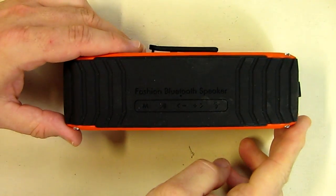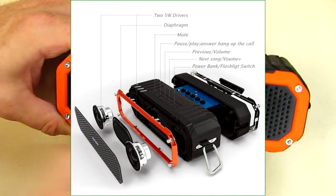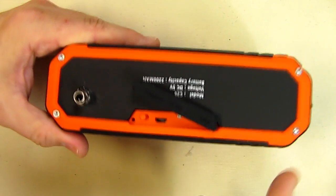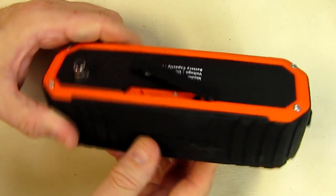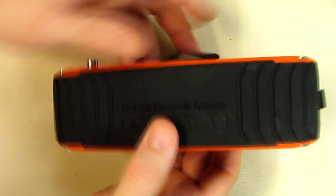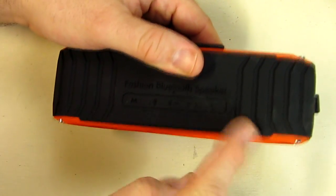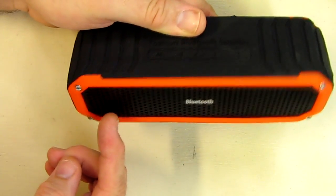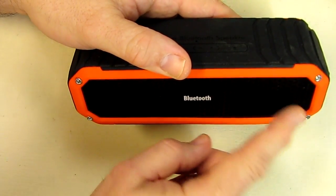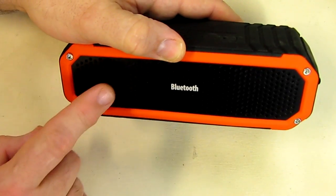So this is a very simple modification to this Bluetooth player. These bolts come off and you can gain access to the speaker, and then on this backside, these bolts come off also, and you take this rubberized piece off quite easily, and you separate these two halves. There's a line down the middle, and you separate them without this rubber piece, and you'll see the left speaker can easily be pulled out. You can pull the right one out too, but you're not going to need to do that. It's just pressure fit. Pull the left one out, and you unsolder the two connections.